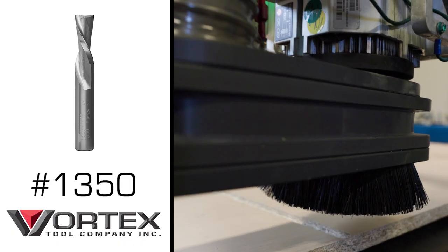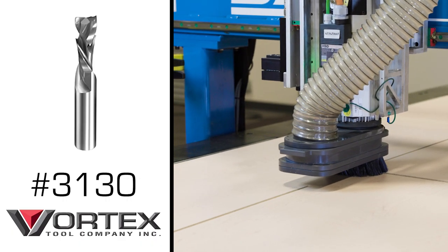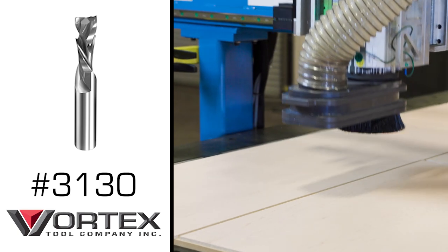Tool number three is gonna be a 2-flute 1/2-inch down cut bit. We're gonna use that to cut out all the dados we need to fit the cabinet together. And lastly, tool number four, we're gonna use a 3/8 2-flute compression bit. We'll use that to get real nice clean cuts, cutting all the parts out. Now that we've got everything covered, I'm gonna load the material up and we'll get cutting.